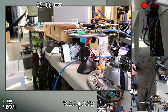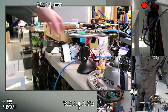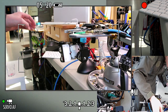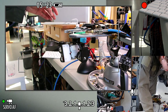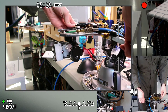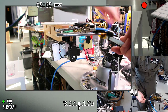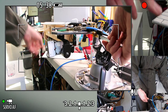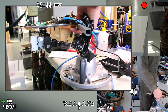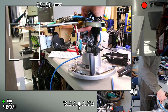Are we going to get a better view, or am I just limited by how long all my wires are? Right now, the three wires I have going to this externally are video, 12 volts, and 5 volts. The 5-volt wire is unfortunately short. I could easily put a USB battery pack in there, but then I would need to restart the Raspberry Pi. Yeah, I can kind of get an idea of what flying over there might look like.